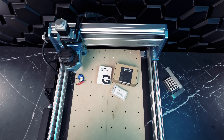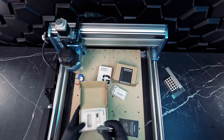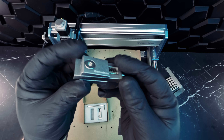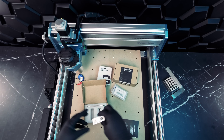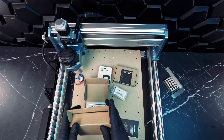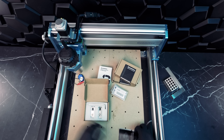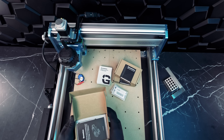Let's take a look at the accessories we'll be using with the machine. First, we have the mini vise tool clamps. This will help us secure the materials from the sides, leaving the full surface available for engraving. The kit does come with basic clamps — they pin down the material, but in doing so they obstruct some of the engraving area, so you run the risk of bumping into your bit and breaking it.